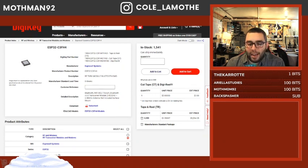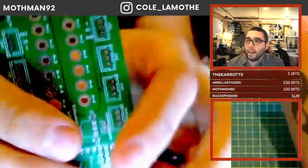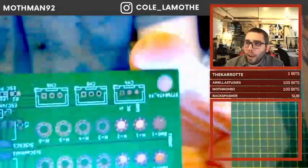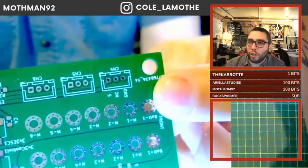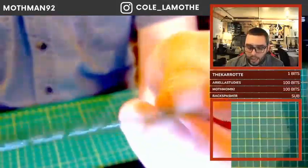And pretty much all the IPC guidelines for PCB trace thickness end at about 35 amps. So we basically had to extrapolate out from there. And then you're also dealing with super big traces, but then you're also going, how do I get some kind of thermal isolation so I can actually solder to the darn thing without reducing my total ability to deal with the whole situation?